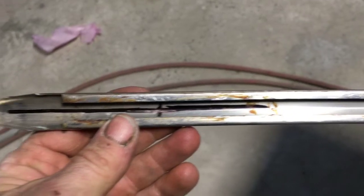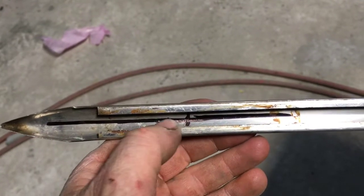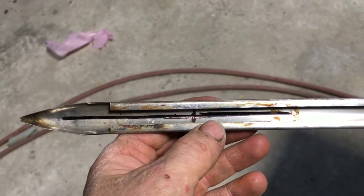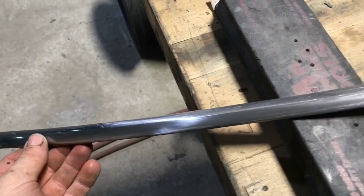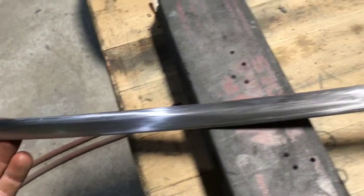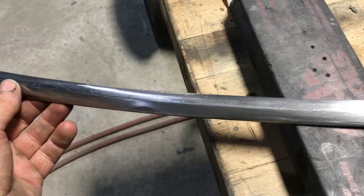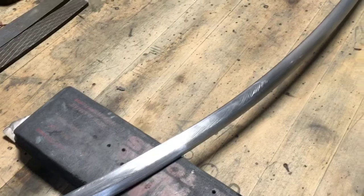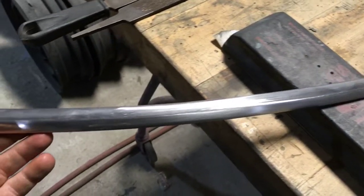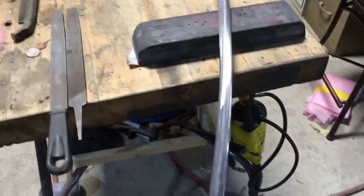And that's where I'm going to be doing other pieces up here on the end. And you got to just go through. You see all the little pin marks right in there where my thumb is. You just got to go through and work out the dents. It turns out real nice, and it's pretty up close. And you just got to do a little hammer and dolly and sanding and work with it and blend it back in real nice. And then you'll see it after I go to polishing. But I just want to walk through some of these dents. It's a very time-consuming process. It takes a little bit of tedious work. Turned out real nice.